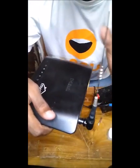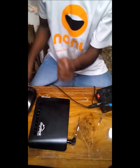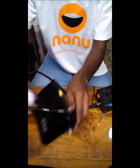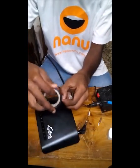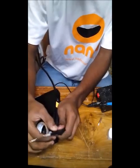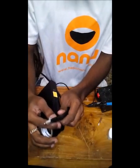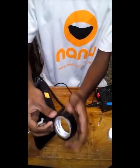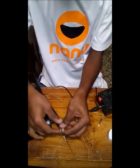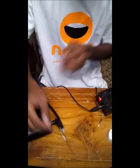Make sure that you do not touch the dipole. Now take the coaxial cable and attach it to the router with insulation tape. You need to attach the coaxial cable to the body of the router, or any force on the cable will pull the antenna out and damage the router. Attach the cable with insulation tape before you solder it. Now bend the inner wire of the coaxial cable towards the antenna and solder both of them together.